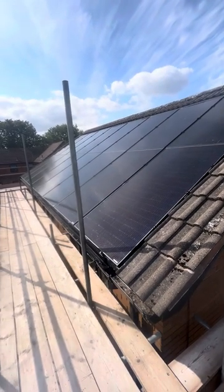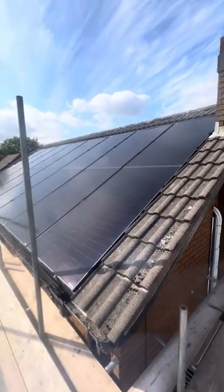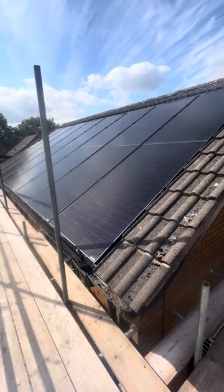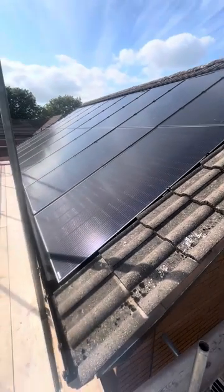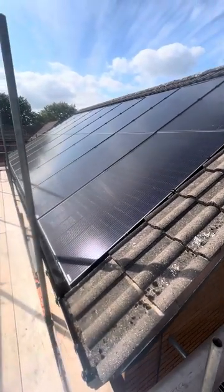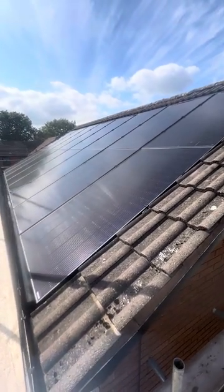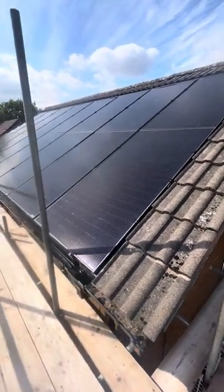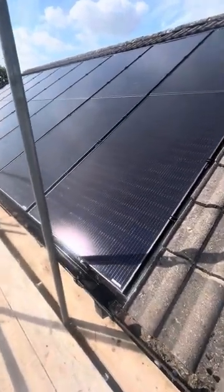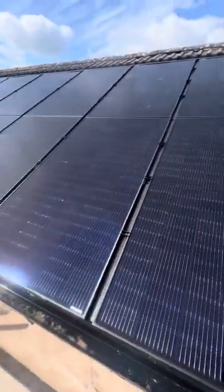When you're looking at it from an installation perspective, it's the Rolls Royce of panel system integration. GSE Integration systems are good for roof slopes up to 8.2 meters from the gutter to the ridge line — as long as your roof slope is less than 8.2 meters, capillary action won't be a problem. Most other integration systems nowadays are poor quality. Viridian isn't the best because if you have a fault with a panel it scraps the flashing system, as you can't undo and remove the panel.